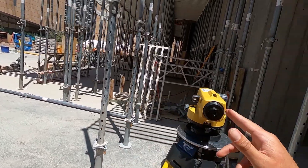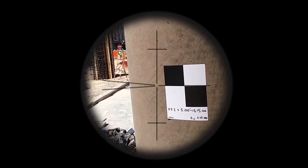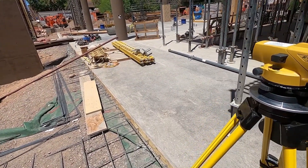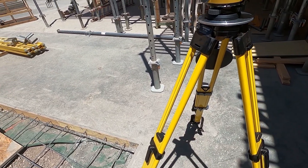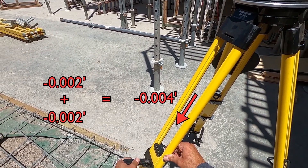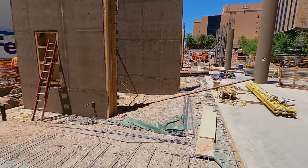Level up again, check my 90. Looks good. I'm going to look at my target — now I'm about two thousandths high. Now that I'm under that hundredth, I'm only going to make an adjustment to one leg, and I'm going to make an adjustment of double the distance of my height difference. So if I'm two thousandths high, I'm going to adjust one leg down four thousandths. This is all approximate and by eye or by feel.